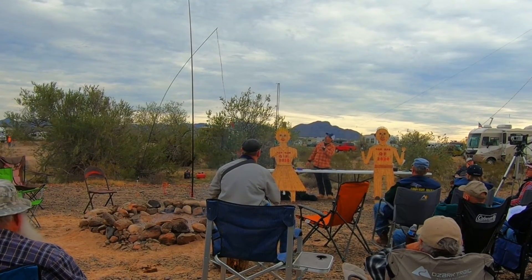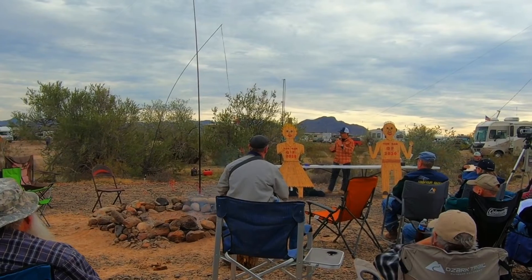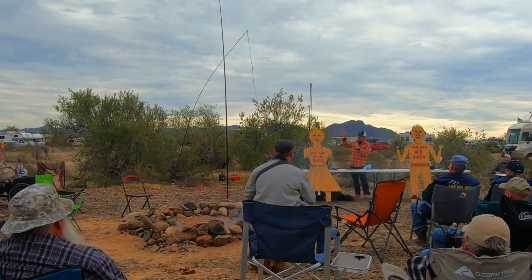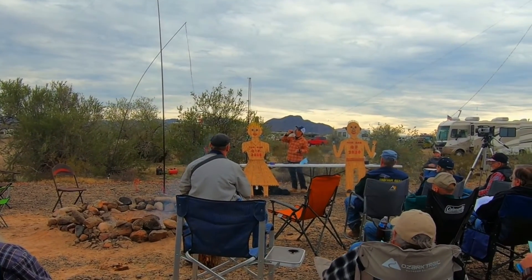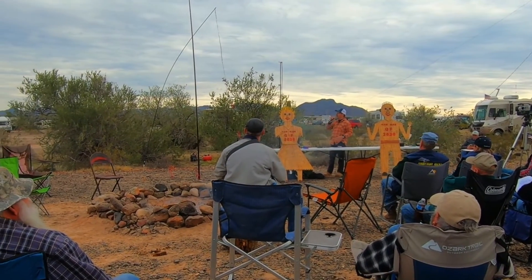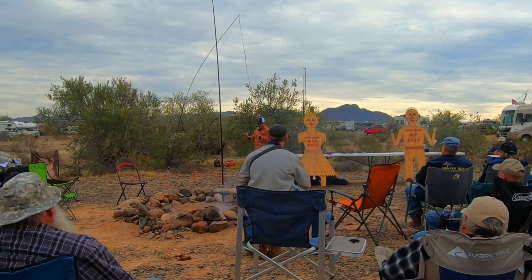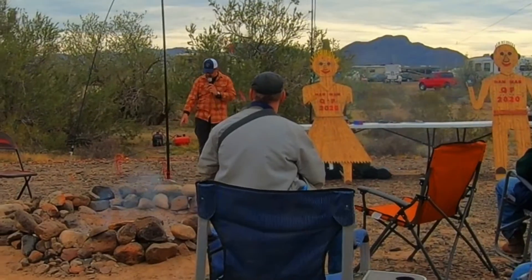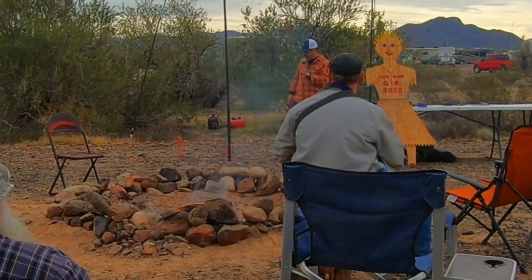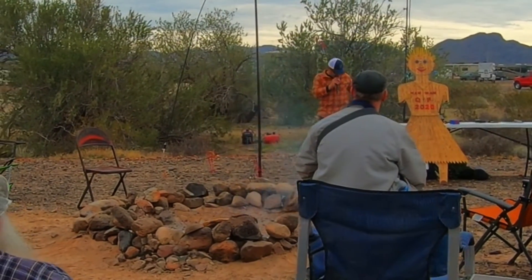The lack of trees is another issue — if you don't have trees, you've got to bring a mast to set up your antennas. I always take a mast with me for my QRP antenna. I've damaged antennas up in trees — they get snagged and I lose them. You also have to think about how to hold the mast vertical. In this case, I used electrical tape and made my own guying lines. It's enough just to string one wire and my SOTA flag so everyone knows what I'm doing.